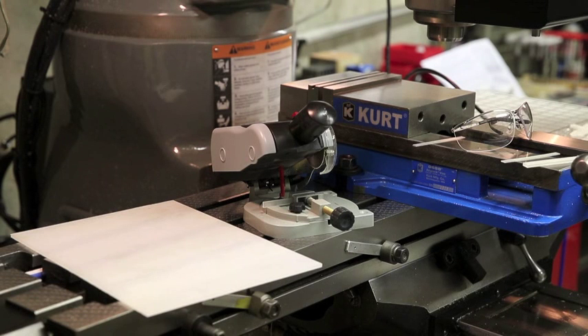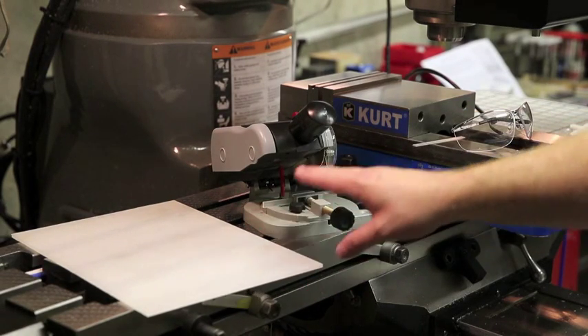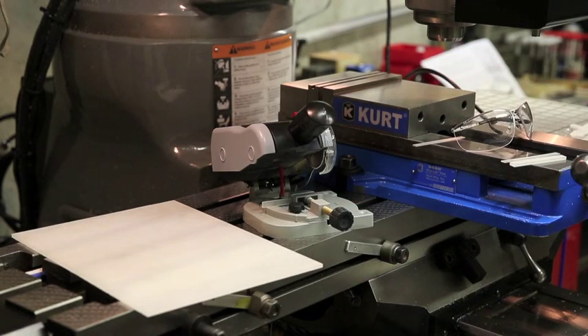This machine is equipped with CNC so it can run all by itself, but every move is a manual move when you're using these traditional methods — going from a plastic sheet, cutting it into strips, cutting it to rough length, and then using the traditional vise to get your finished dimensions. And best of all, the tolerance on the job is plus or minus a thousandth all the way around, so there really isn't a lot of wiggle room for error. So I started looking into a vacuum plate and that's where I found the Pearson Smart Vac.